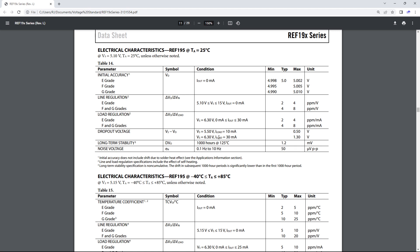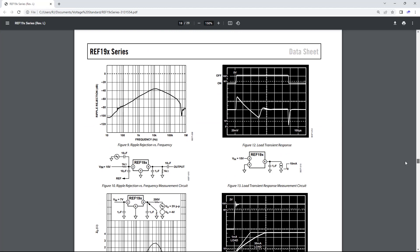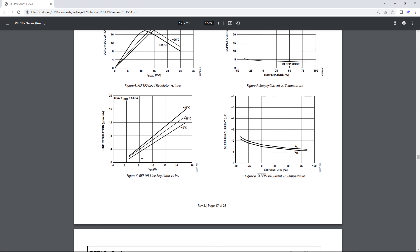It operates on a wide range of voltage. The dropout voltage is 0.5 volts at 10 milliamps, and the dropout goes up as the load goes up, but our load is going to be very insignificant — we're talking microamps. Meters are extremely high impedance devices. So this half-volt dropout will easily meet that requirement, and really all we need is to be somewhere around six volts. The problem with using a nine-volt is the accuracy gets a little worse as your input voltage goes up. Since we're out to build something accurate, let's keep the voltage down at the low end.